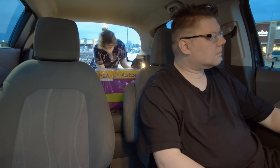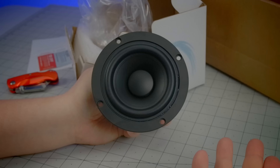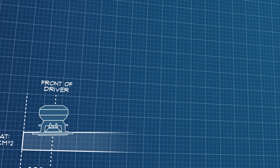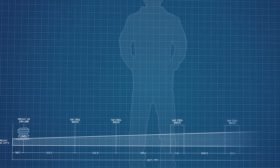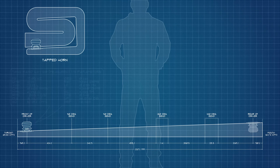Well, I've been chewing at that, thinking about the laser, drafting some ideas, ultimately arriving at 4 inches. It's the size of the sound that matters, and we'll take care of it by coupling the driver's output to this nearly 2.5-meter-long expanding waveguide, folded onto itself to form a tapped horn.